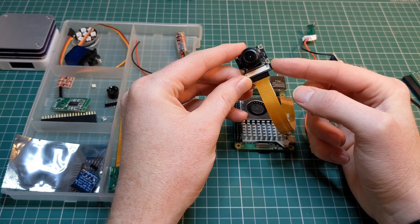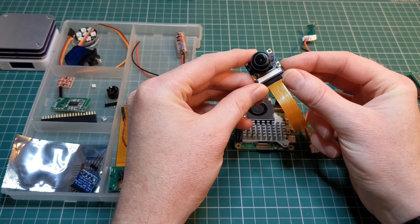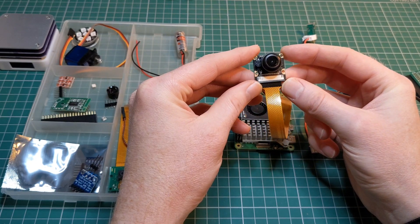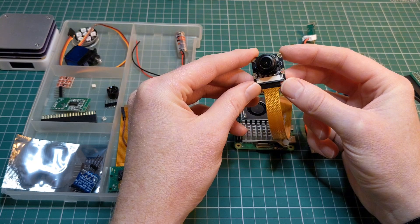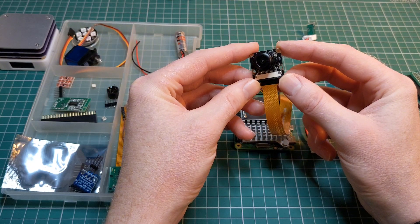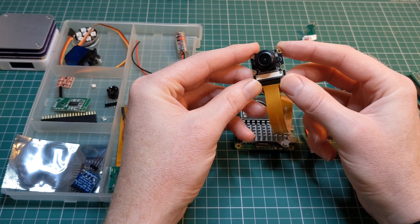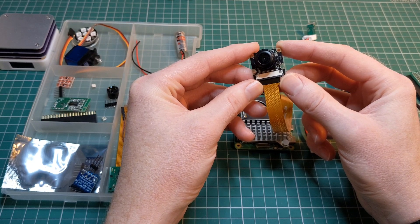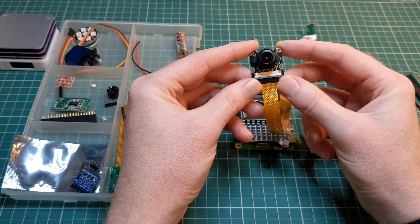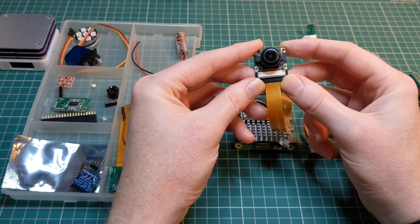I've also been working on testing the existing camera on the Raspberry Pi 5, and I'm finding there are some firmware or software limitations around quite a lot of the functionality that I had working on the Raspberry Pi 3B+. For example, the Raspberry Pi 5 initially didn't support this version of the camera — it's a third-party camera, not an official Raspberry Pi camera, but it uses the same hardware. Raspberry Pi very kindly created a fix involving a firmware update to a specific pull request from their source. In future this pull request will be merged into regular firmware updates, but for now it's something you must do specifically. If you're experiencing this problem there is a guide on the website that talks you through the workaround and how to apply it to your Raspberry Pi.